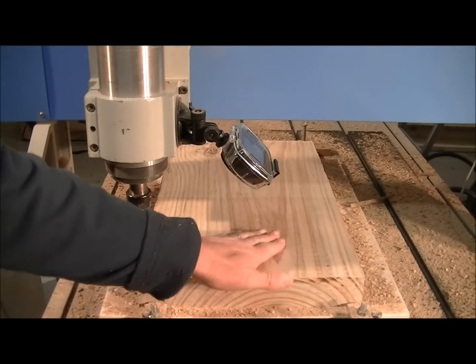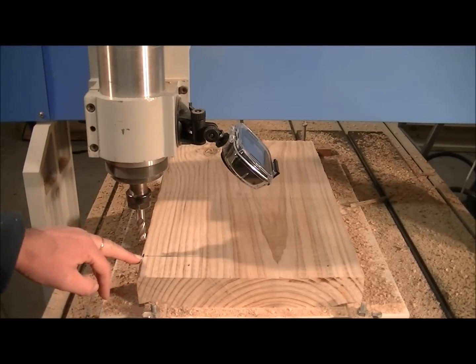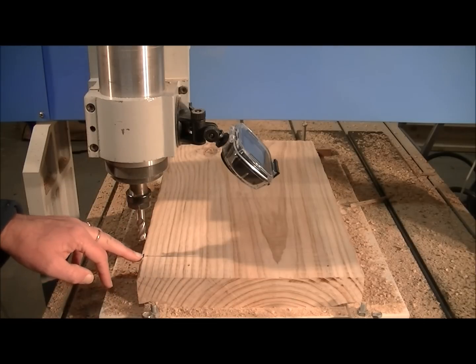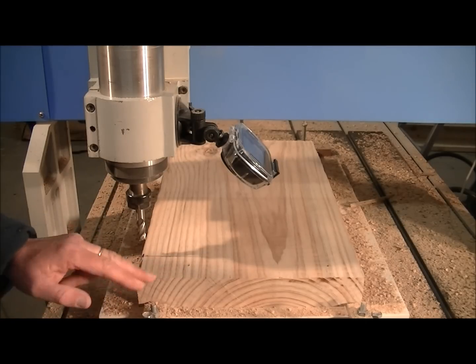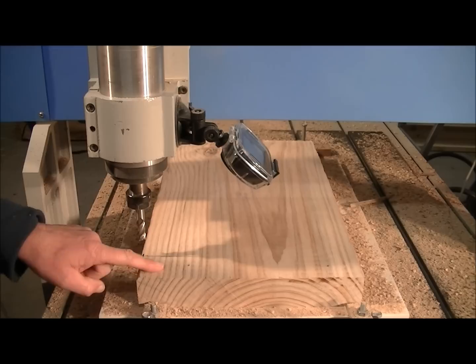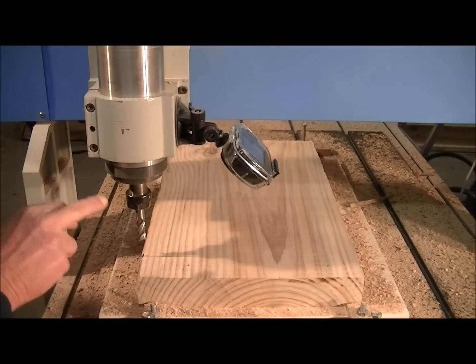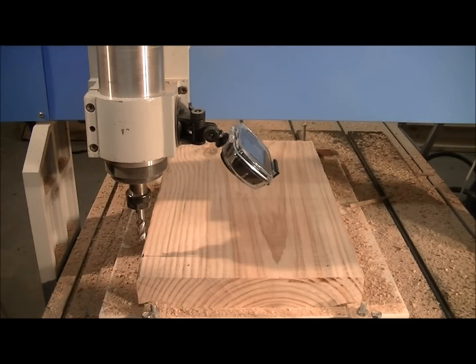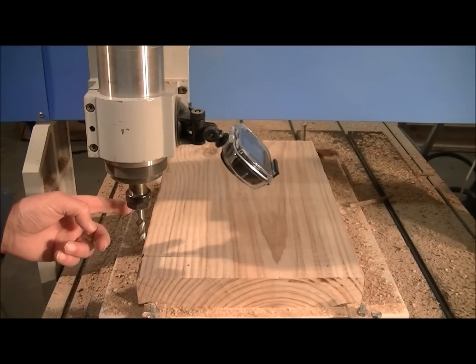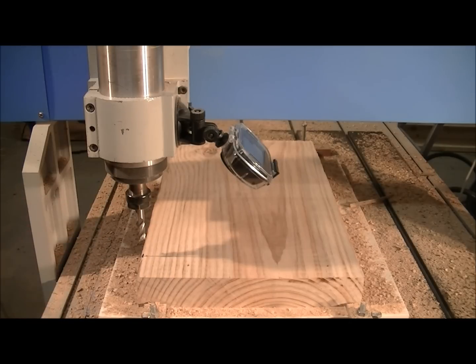I've now surfaced the other side and I now have a new zero point or reference point. The 3D cutting program starts now at this front left-hand corner. The reason I leave such a great amount of material here is because each time I change a tool, if it didn't have this material here, I wouldn't have anywhere to reference where the Z0 was for the particular tool in the chuck. So that's why I leave a fair bit of material here, so I can reference the Z axis zero for whatever tool is in here.